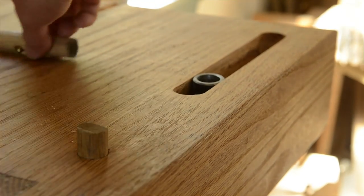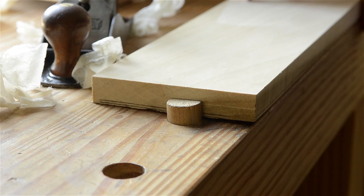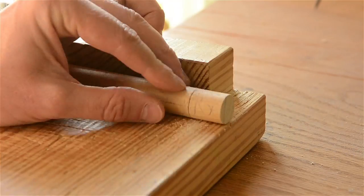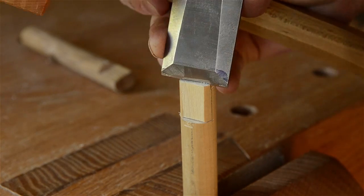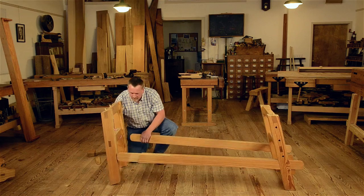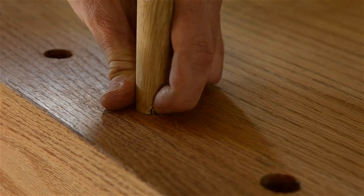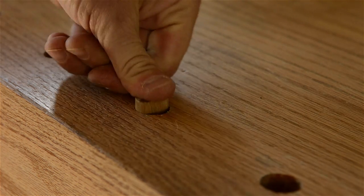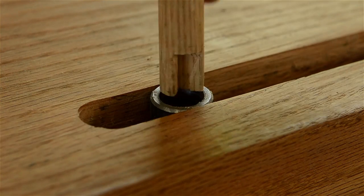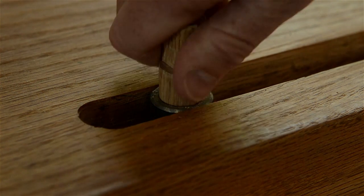To make my bench dogs I buy wooden dowels from the hardware store. I've used both three-quarter inch oak dowels and one inch poplar dowels, and both wood species have worked just fine. I cut them to length — a little longer than the workbench's thickness is really nice — and then I use a hand saw and chisel to add a flat face to the top of the dowel. I sometimes also add a notch to the bottom end so I can hold abnormally shaped pieces of wood. My friend Will Myers introduced me to a cool way to keep round bench dogs from slipping down through the bench top: bore little holes in the bench dogs and epoxy small cabinet door latches inside. Square bench dogs usually have different types of spring methods for holding them in place, but it's a similar idea.